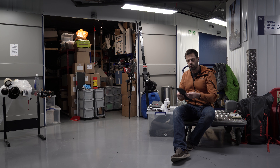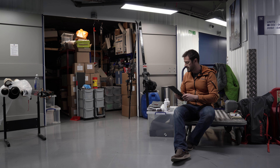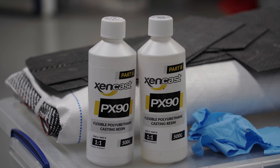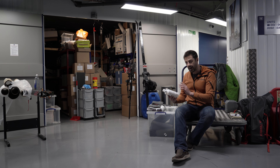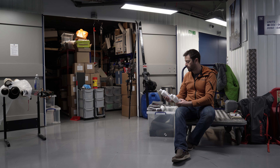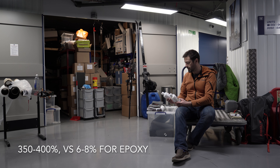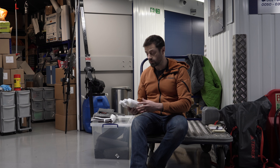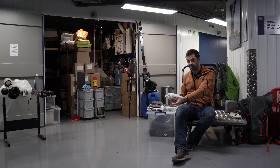With that in mind, a second little experiment with two aims. You may look at these two pieces of black composite — both the same thickness and almost exactly the same weight — and wonder what the difference is. The answer is they've been set in different resins. Carbon fibre is the reinforcement in both, but one is standard epoxy resin and the other has been set in a flexible polyurethane casting resin from Easy Composites. You can set reinforcements like carbon fibre in these to change their properties. Even though it's officially a casting resin, it's the stiffest in this particular range, but it still has a long elongation to break. I'm exploring whether there are applications within the Bernard project where it could actually be superior to epoxy resin.